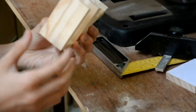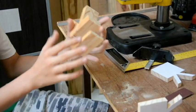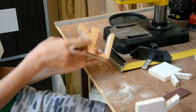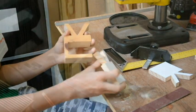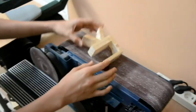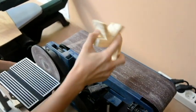Now we're actually just gonna sand out all the inside surfaces — for example this side, this side, this side — because you can't sand them again once you stick the pieces together. These sides need to be done first. I think I'll use the belt sander for this side and the sander stick for the other side. Now we're just gonna sand this side — let's just get started.